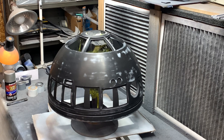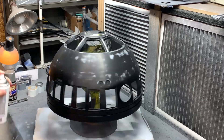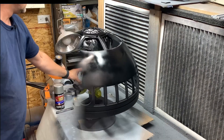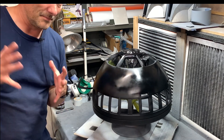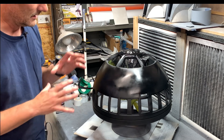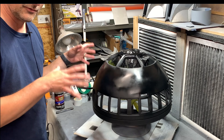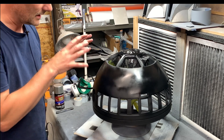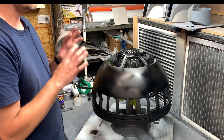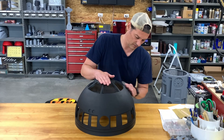And then we're going to use steel wool to smooth that out. If you've watched any of the previous videos, you'll know I am not at all a fan of gloss black — I don't want to wait on the cure times. Now that I've put down my flat black prime coat getting ready for the silver we're going to add, I'm going to let this completely cure — probably wait 24 hours — and then I'm going to go through and lightly steel wool everything to sand it smooth again so it's a full black coat.